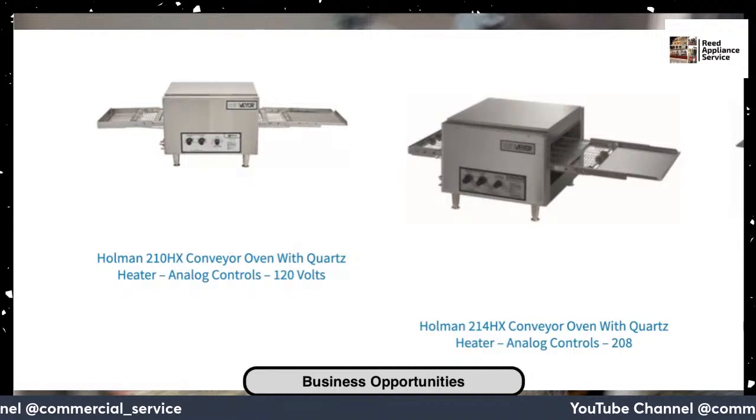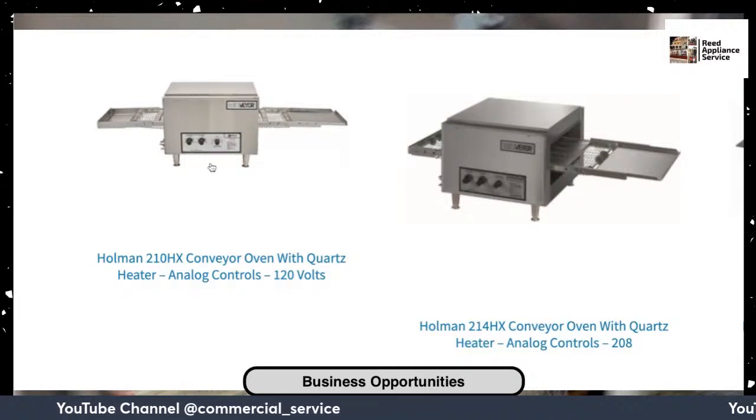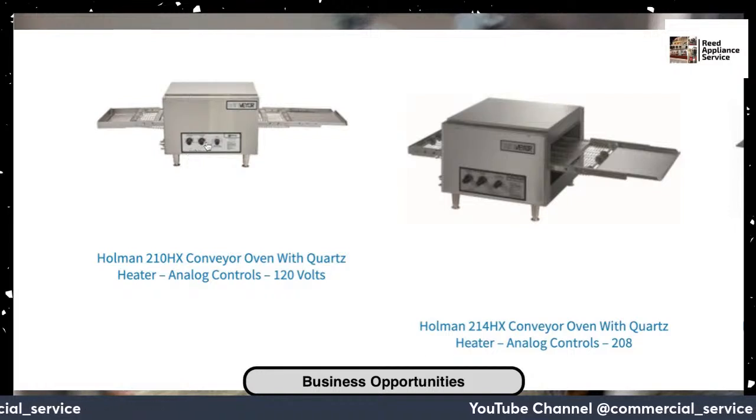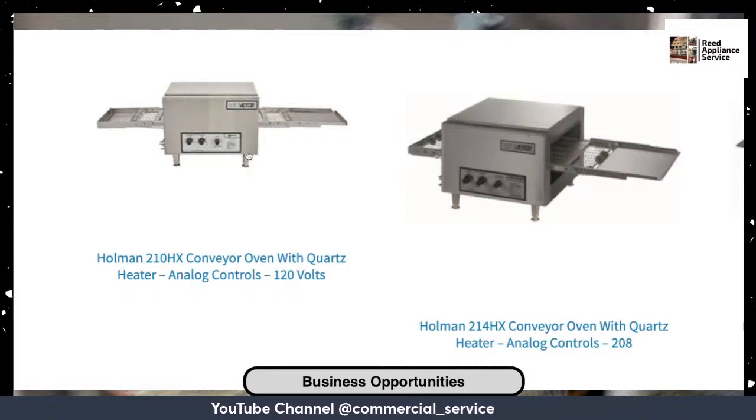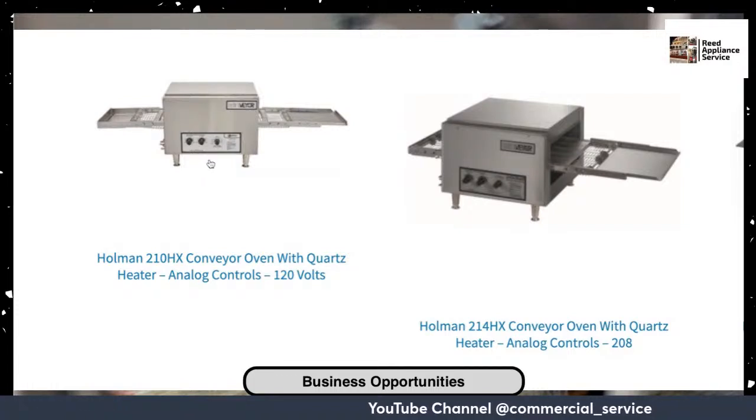underneath. That cooling fan also has a high limit switch next to it. And so once that cooling fan gets blocked up with lint, debris, that cooling fan is going to trigger. And that will stop this machine from working. So then you'll have to go and hit the reset and then clean everything out, or hit the reset and then go ahead and change the fan motor. So those are very common things.